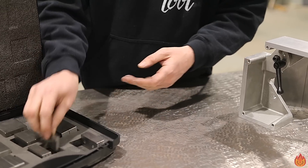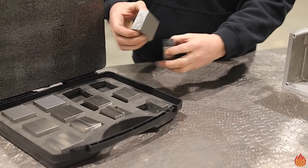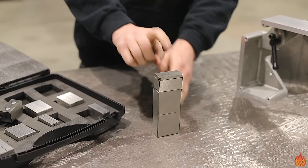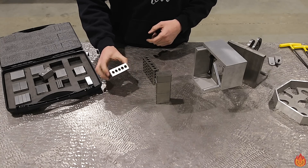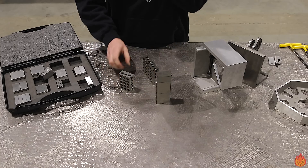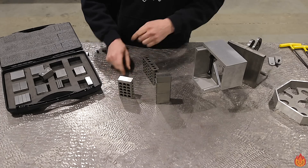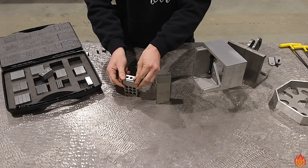I don't know how many times I've run around the shop looking for something five and a quarter inches tall to hold a part up. Well, I know that this is four, that's five, and you want a quarter — done deal. There's five and a quarter inches exactly; I didn't have to go to the band saw and cut something. If you're a machinist, you've probably already seen these as 1-2-3 blocks — these are also great for fabricating. They're one inch wide, two inches thick, three inches tall. Now that they're the same dimensions, I can get three and a quarter inches just like that combined with the existing 1-2-3 blocks you might already own. You can move them and set them around and they're not going to slide off. It'll really help with your setups around the shop.